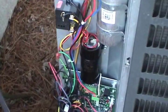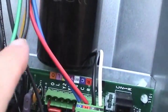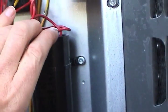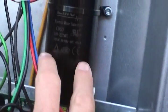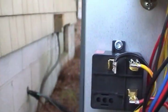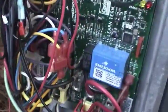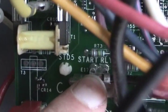That worked out really well — everything is all mounted up and connected electrically. This arrangement worked out nicely, letting the capacitor rest on the mounting plate for the circuit board, keeping it away from the board but with a solid mounting arrangement. The nylon strap's not going to let it go anywhere. I've got the ratings facing outward so I can easily check them when this eventually fails, terminals facing up, and the relay mounted really nice. Goodman actually designed this with a terminal labeled 'Start Relay,' so this system was designed to have this optional start relay installed — that's basically where your black lead goes for the start assist.